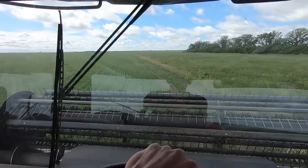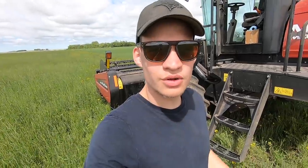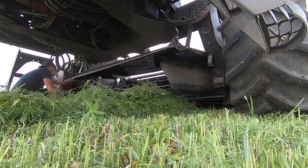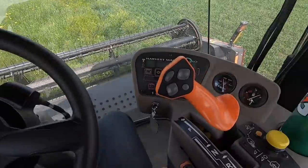It's pretty sketchy with a header on there when you're driving backwards, so since the field's close enough we'll just drive straight there. That field of grass is way back there behind our field of wheat, so I'm gonna have to trample some of this wheat to get out there. I gotta go down there and adjust the width of the swath — we want it wide enough that it's still gonna dry, but we still need that swath to have enough volume so we can rake it up and bale it. If you throw it too thin, since this crop is super thin, we won't be able to pick it up well with the rake and the baler, so we're gonna make it throw a tighter swath.